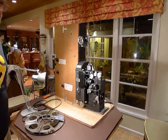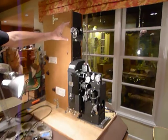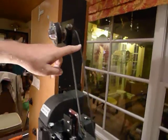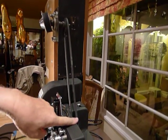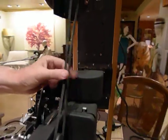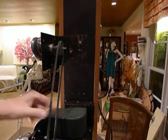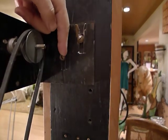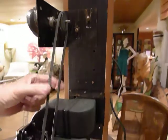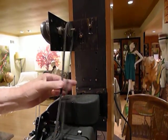I'm going to show you the correct way to load a film reel onto the Panoram. The first thing to do is make sure that the offset film bracket is in the correct position so that when you load your film drive belt on, you can spring it together and have it touch — not too tight. You can adjust the tension by loosening the two screws on your bracket and moving it up or down. If you can touch them together and it's not real tight, that's correct.